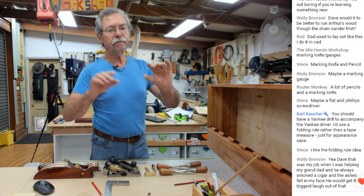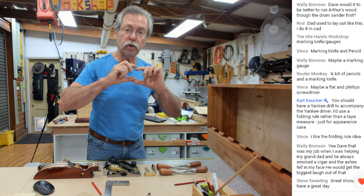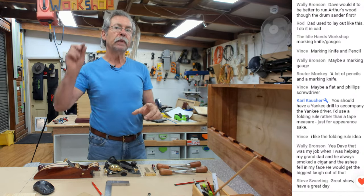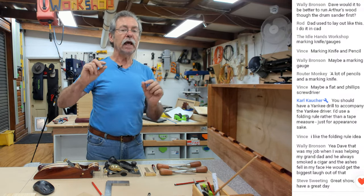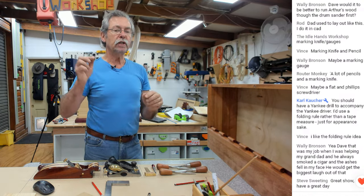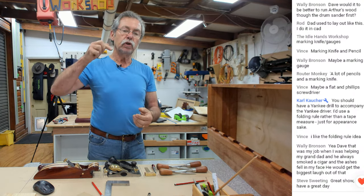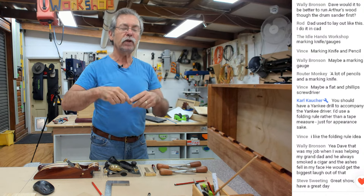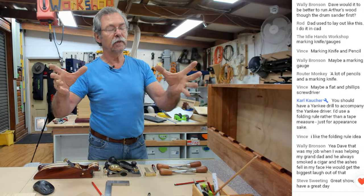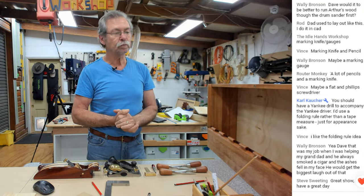Again, whatever the female depth is total, your male start depth and flat depth have to be the same total. So if it was 10 millimeters deep for the female section, I would have possibly gone 7 millimeters deep start depth and 3 millimeters flat depth. But if you're going to go that deep on your first pass for your start depth, you also need to do a clearance path in whatever software you're using for the CNC so that you take out that part before you hit your start depth. You follow? That's on the outside of the vector. Remember, it's got to be working on the outside of the vectors that you make for the text. All right.